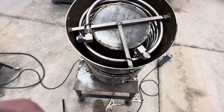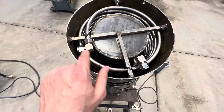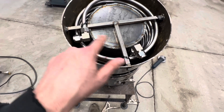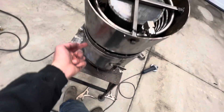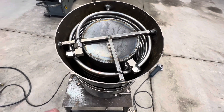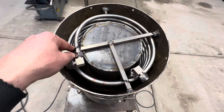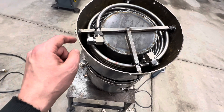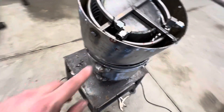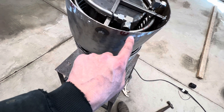I've made some good progress — I managed to get the heat exchanger coil cut short and I've been trying to get everything to fit inside here so that I have enough room to get these compression fittings on. They also have to go through the side, so it's all timely to be working on this rim area of the waste oil burning water heater at this time. I gently bent this lower tube by hand — bending the stainless is a pain, but I was able to get it formed how I like it. Now we're going to use a drill to cut a hole in here and make a little U-shaped cutout.